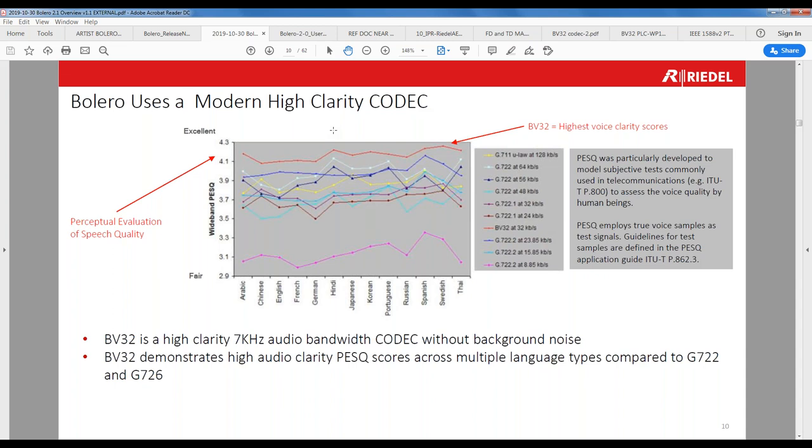And in our system, unlike other systems, we're able to go through a packet loss concealment process where we actually predict what the missing pieces might have been and insert a reasonable facsimile of that in place of the missing packets. Other systems do what's called zero fill or ramp to zero, which results in nothing more than audio artifacts and missing information. So that's what we mean when we say perception. We are able to perceive no matter what the environment. We can tell what the words are that the director is telling us. We can understand the direction that they're giving us if we're a cameraman out in the field. We can do it in a high noise environment and we understand what they're saying.